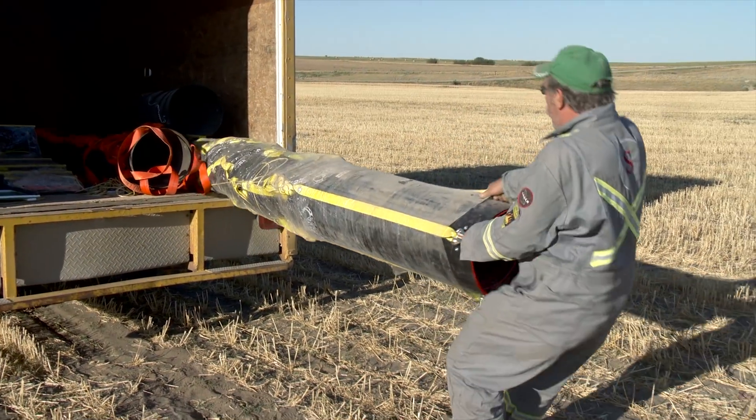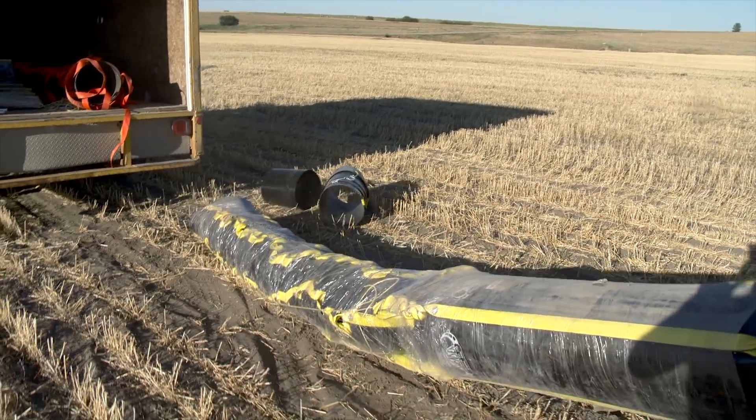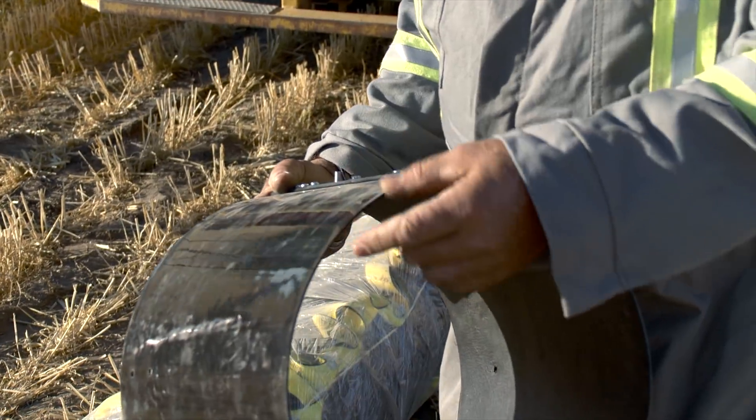You get 24 to 26 feet of travel, and if you tweak it just right you can get 28 feet — which translates to around 1,200 to 1,400 bushels dumped at once. The spout can stretch to over 30 feet on the auger, but in its cellophane shipping wrapper it's only 13 feet long.